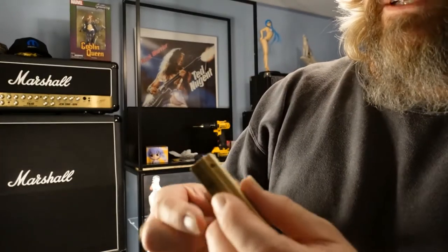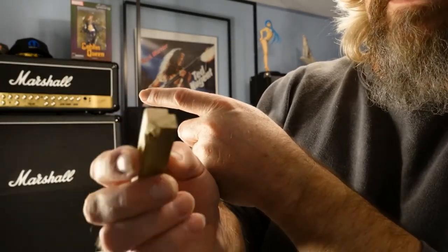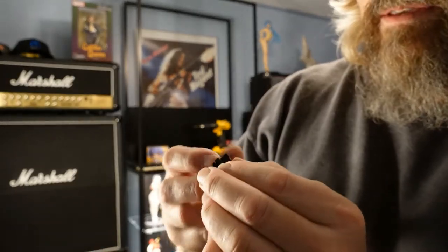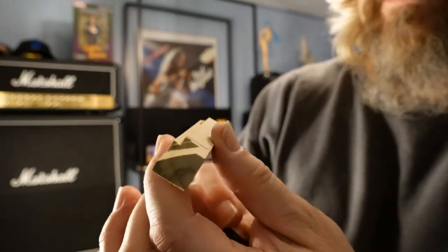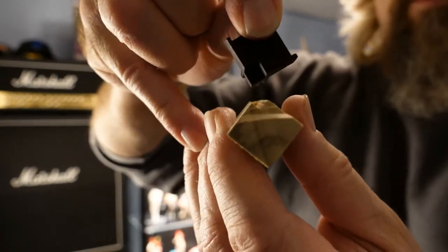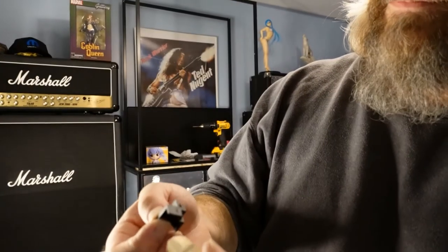Now what I did is I cut from that same 5/8 stock. I cut 3-inch pieces of that stock. I put a notch in it because if you notice, this too has a notch. Okay, so I match that notch. Yeah, see what I'm saying? I'll show you both sides facing each other. I match the notch in that angle. So that'll fit right on top, just like that.